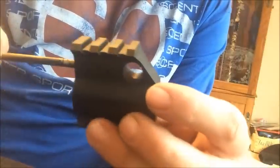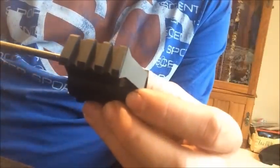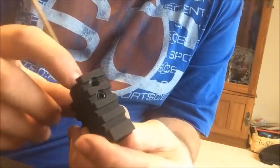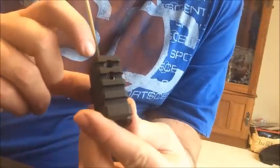The large hole goes into the gas block straight down. As you're sliding it in, you're going to want to line up the smaller hole for the roll pin. You can do that by looking down into the hole while rotating the gas tube as you're inserting it. You want to make sure that the large hole is facing downward, and if you notice inside your gas block, there's a corresponding hole for the gases to escape from your barrel into the gas tube.